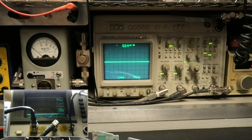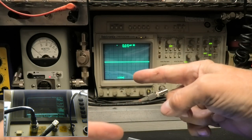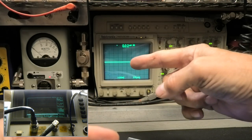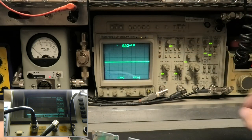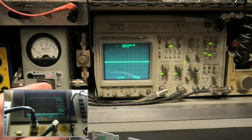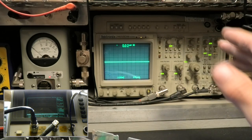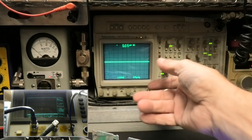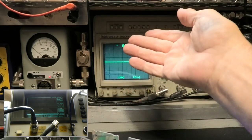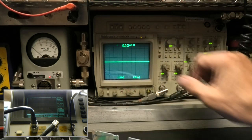So what I'm going to have to do is turn that into a 20 megahertz scope, and we're going to have to do a flip. You have to use your imagination, not something crazy down the yellow brick road, but I'll double scale. I normally always double scale everything, unless it's going to be over 4:1 and you can't see it. Usually I'm always one bar up, one bar down. A 100 megahertz scope can easily double scale at 27 megahertz. The vertical amplifiers are more than sufficient then to be able to read the voltage.